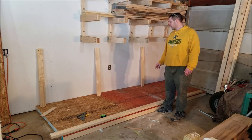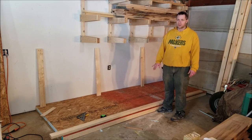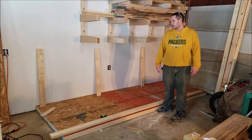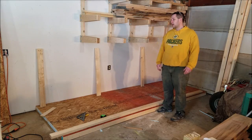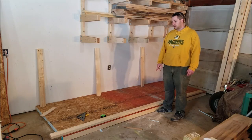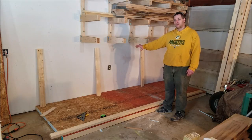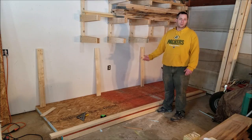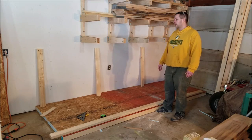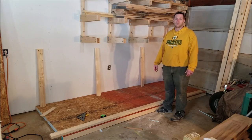So what I did — I cut down four 2x4s to 40.5 inches or so. They're all the exact same length, which is more important than their exact measurement. They're the front and back posts for each of the sides. I'm going to use them right now to help position the 12-foot 2x4 on the back wall. I'm not making a separate back wall — the wall itself is going to serve as the back wall. It's insulated, so it should be just fine, and there's an outlet in there so I can use that for the power for the dehumidifier.